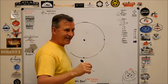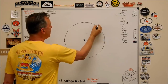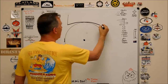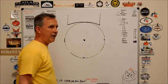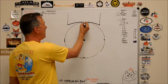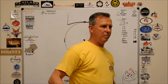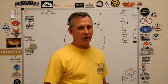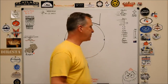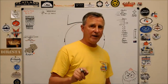This is horribly exaggerated, but when you have a large radius holding a small radius, what you got? You got tangent point contact. You've completely thrown the whole benefit of a soft jaw out the window because, ooh, it fits. Don't do that. You want a smaller or identical radius